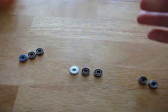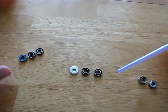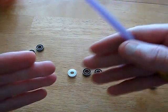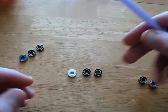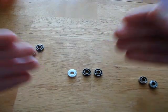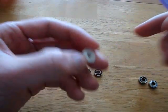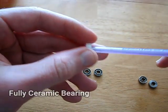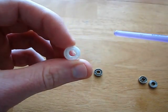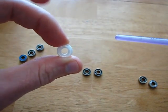Reviewing some of the bearings here — these are all five by eleven by four bearings. In this case where all this is low impact and you want the lowest amount of friction, you're going to want to look for open bearings, or bearings that can be opened. This is the only kind of bearing I found that was open, but it's very expensive, probably about ten dollars, which is just a little bit too much, but I bought some just to test them out.